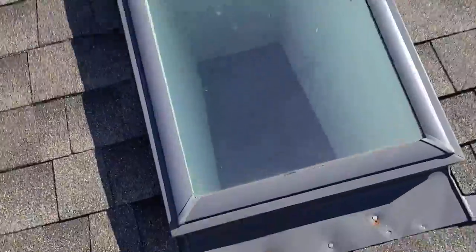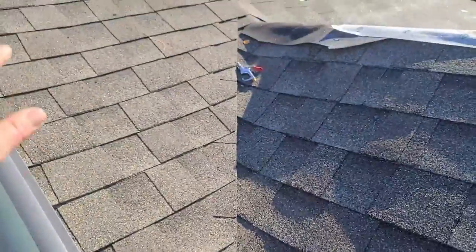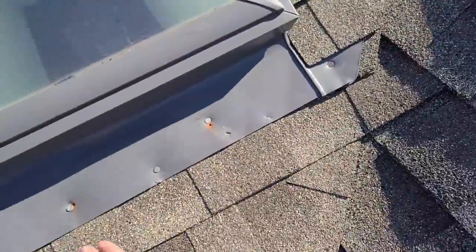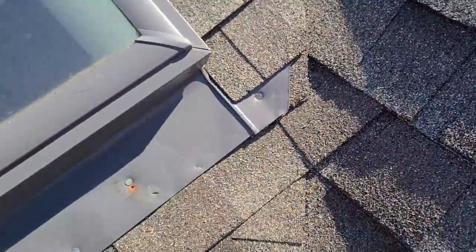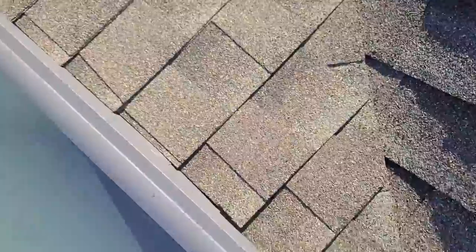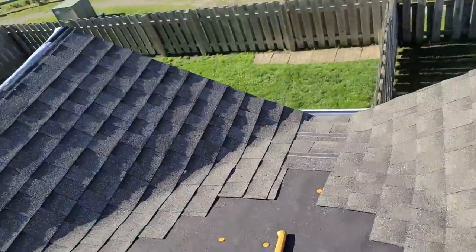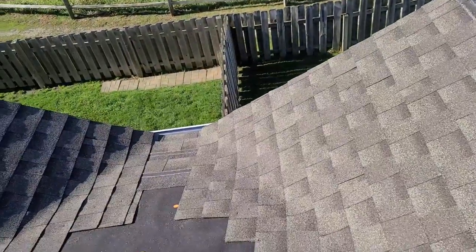So I did this sweet little reversal on mine. This guy looks crooked as hell. But anyway, I ran it the correct way because this is an equal pitch and everything. But you see, I ran this shingle under one more time because they got this skylight so close — almost like a reverse valley, but then I continued it off the same way. Anyway, we're going to do bottom side first this time and get it done right.